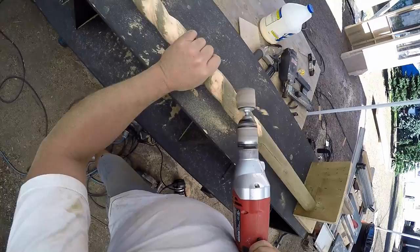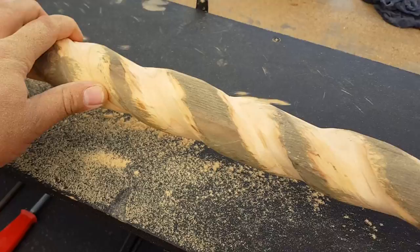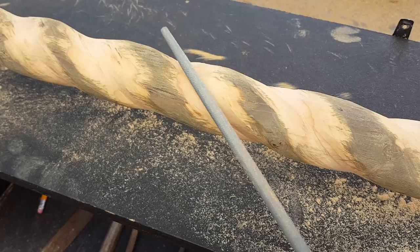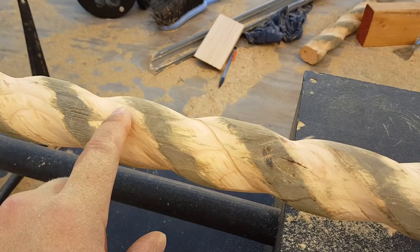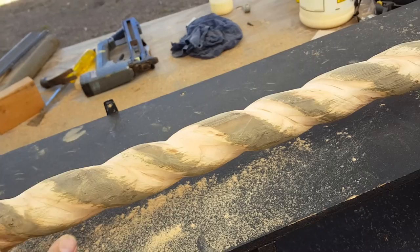So now that I got that kind of evenly sanded with that drum there, you'll notice some of these deep grooves that I did with the grinder. You can get a lot of this out by using just an assortment of files. I'll use this round one to kind of take out anything that's in the center there, and then anything that's a little bit wider, I'll go through on the sides. And then I also will use the grinder again to do anything that's really deep — just really lightly, carefully mold it and keep shaping this thing. When we get all finished shaping, I'll take a finer grit sandpaper and just go over this and smooth it out really good.